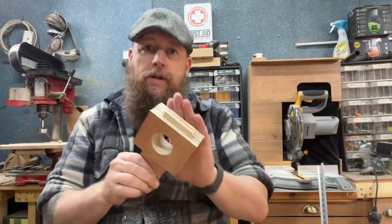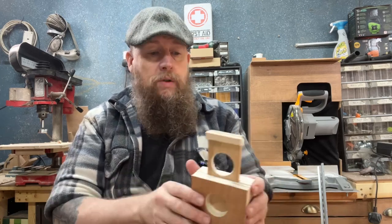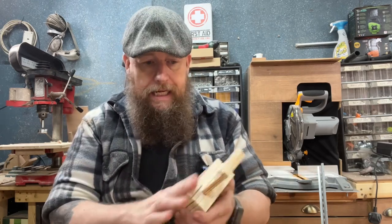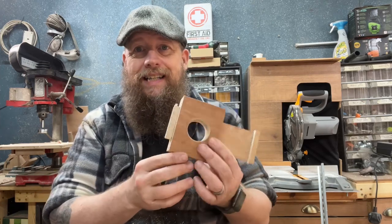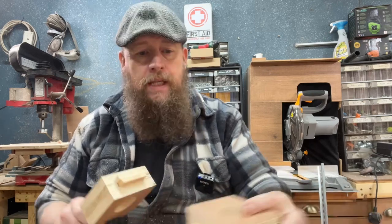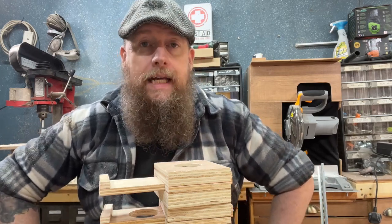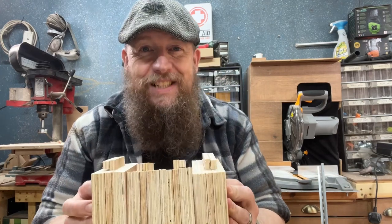I wanted to use plywood because, as Keith says in his video, drilling big holes in MDF is a bit of a nightmare. Also, plywood should be relatively stable in the workshop — it won't shrink and expand. If you make it out of hardwood it can move around, and it doesn't take much movement for it to get stuck. You can file down the edges and make it look a bit prettier if you want. But that's it — that is my blast gate for my 40mm system. I've got four done and one more to make, then I can get the system up and running. Hopefully you found this useful — please like and subscribe, and hopefully we'll be hitting a thousand subscribers soon!